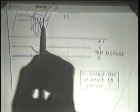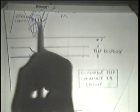And this, allowing the luminance FM signal to extend the lower sideband, apparently increases again our high frequency response a little bit. It's another one of these small changes that tends to help to give us the better high frequency response. By itself, it probably doesn't do a hell of a lot. Be aware that that circuit exists, and it can give you a problem, I suppose, someday. That is, if ever our machines give anybody ever problems.